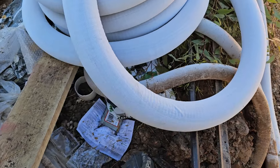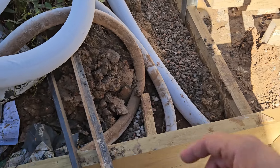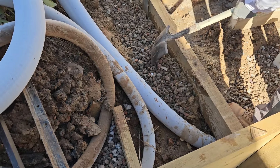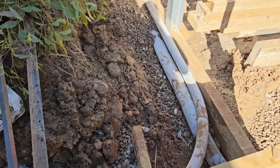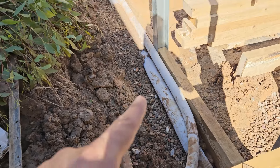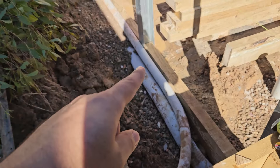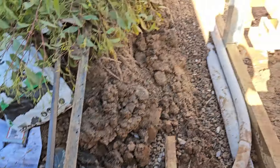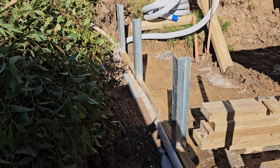That's the ag pipe we're using: 100mm by 20 meters long, with socks as well. We need more here. Next step is setting the pipe. As you can see, we have a slope from that corner to here. This top pipe is for this retaining wall, connecting to the stormwater in the other house. Then we fill it up and go step by step, course by course to the top.